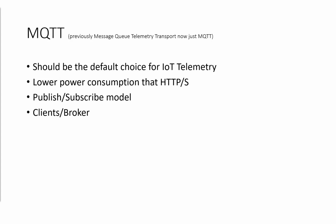So MQTT is kind of the HTTP of the microcontroller world, where HTTP is going to be used on your web browser. It should be the default choice for all IoT telemetry. It's really low power consumption. It has very minimal overheads, and it's designed with these little boards which are battery powered in mind. It can operate over HTTPS as a transport protocol as well, so there's security baked in. It's also working on the notion of a publish and subscribe model. So you publish data to a server as a client, or a gateway or a broker. And then equally so, you can subscribe to every time that information on that server changes.